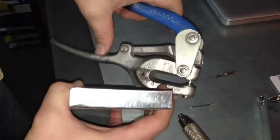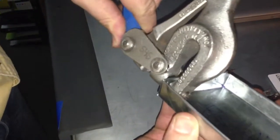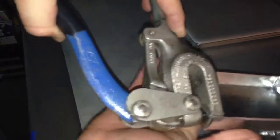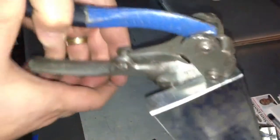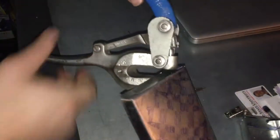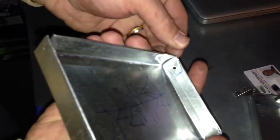Take the Whitney punch and open it up. You're going to slip it into the opening here, and we want to make sure on the inside that we are catching that tab. Then we're going to bring this down and try to get in the middle of the tab like this, and we're going to punch through both layers. Before we punch through, we want to make sure it's squared up. So push that in a little bit, then use two hands. And then you have to pull it all the way apart so it opens up, and we should have a hole punched through both the tab and the side of the pan.